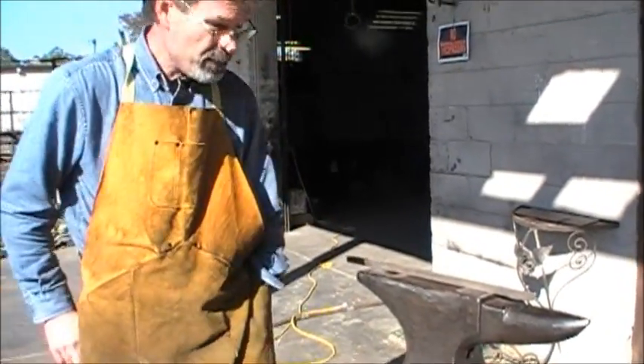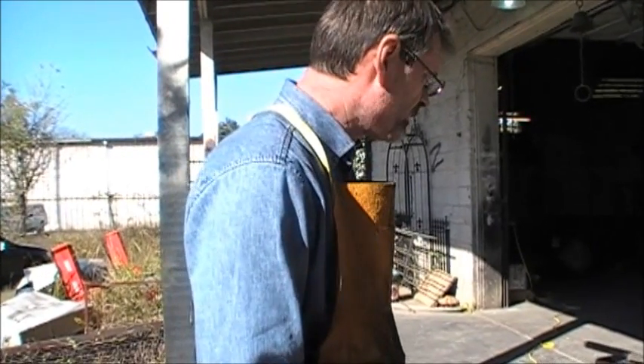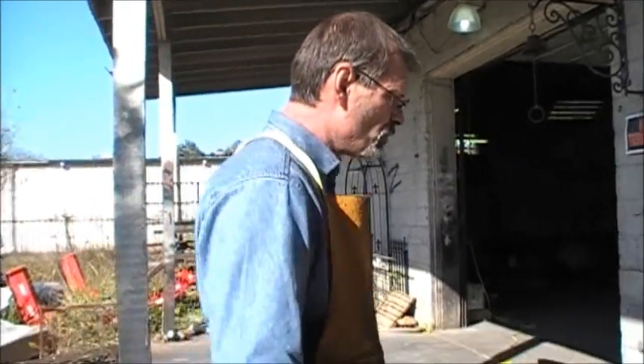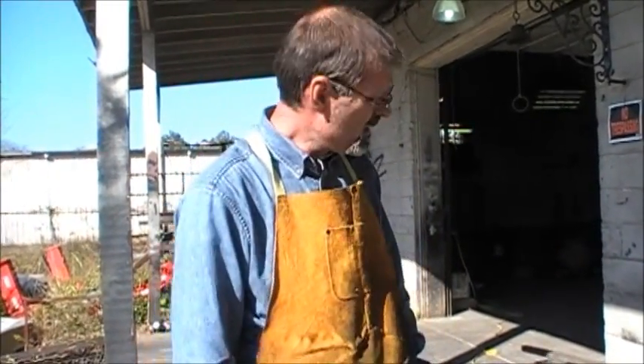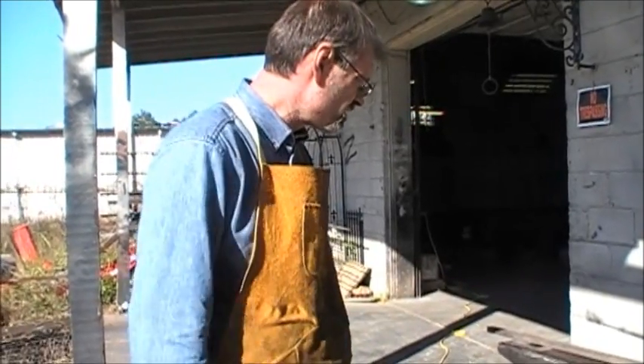Now I'm attempting to bring the face — the table — to a pretty nice surface. I'll try to get it perfect, though I'm not sure I can. I took it to a couple of different machine shops and they couldn't do it — they said it's too hard. So I have to do what I was afraid of: by hand, by grinding, trying to get a nice surface. After that, it's going to be the hardening process and the tempering process.